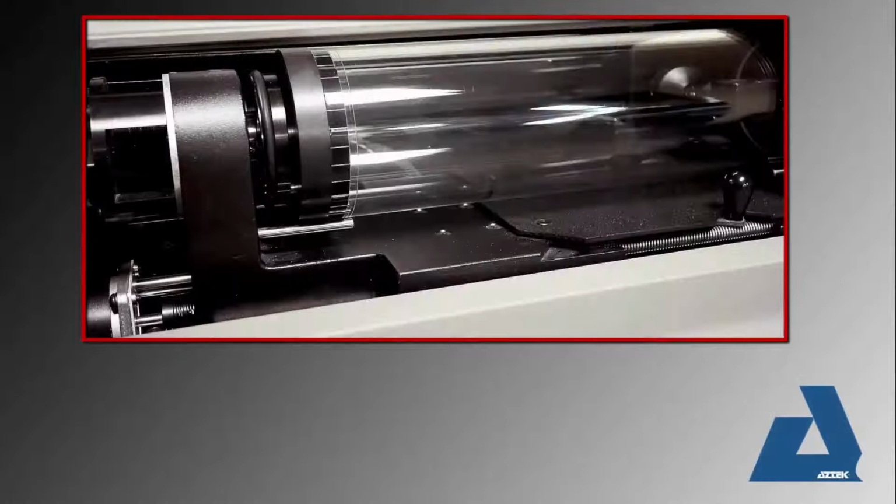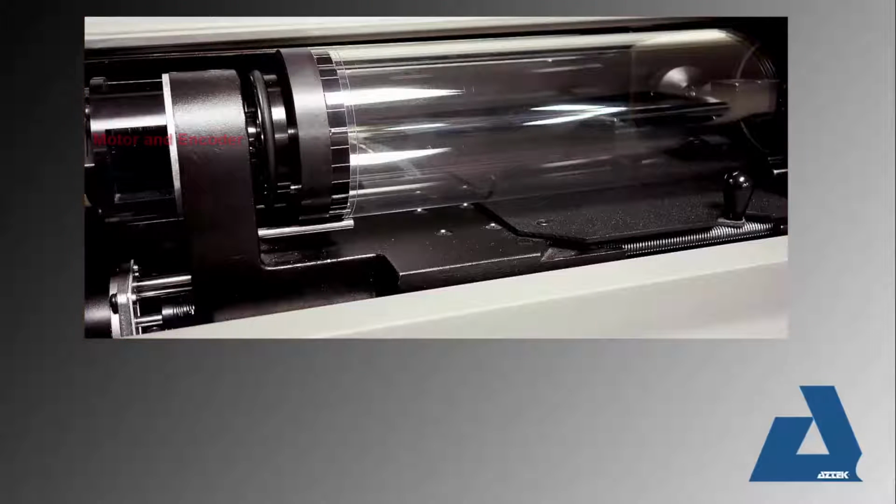So moving now on to how the drum scanners work and the consumables involved with them. On the left side of the carriage is a motor encoder that actually spins the drum. Below the carriage is a motor and control that moves the whole business from left to right in front of the optics box. When you ask for 4, 5, or 8000 DPI, what you're really telling the scanner to do is stop on this spin and movement to take a sample.